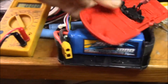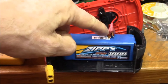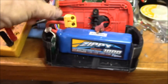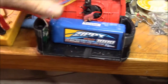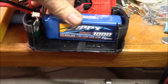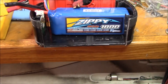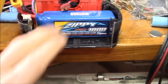The third option is to just use the power connector post inside the top of the battery - an XT60 connector, not a Dean's plug - positioned just underneath the top. The balance plug would run out the side of the pack, and I'd hook the fuel gauge into the red and black wires, since the fuel gauge is completely standalone. Doing so gives me a bit more room because I don't have that heat sink, so I could actually fit a 2450mAh LiPo pack in the same spot.